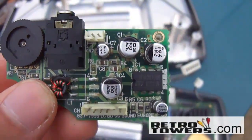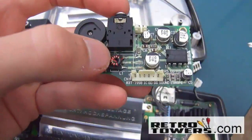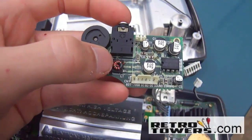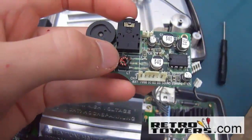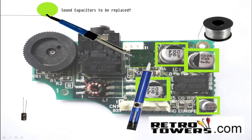The two smaller capacitors are usually what is wrong with the soundboard, but it's always best to replace all of them so the Game Gear will last longer, and one of the bigger capacitors could have a problem anyway. When replacing capacitors, please make sure that positive and negative are aligned correctly. This is another animation showing how to remove the Sega Game Gear soundboard capacitors.